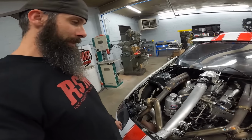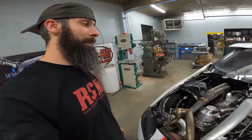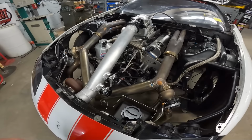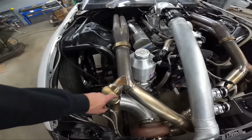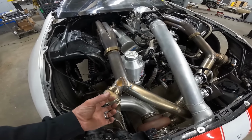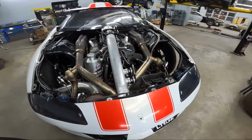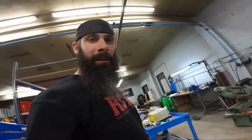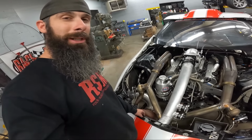Everything is put back together, and we got the piece of the pipe welded in, and he is ready for PRI. Besides a good detailed job, the pipes went in pretty good. Had to work on getting this back around where I cut it close to the 90 and it ovaled out really bad. So you can see me going around with pliers and tacking it every half inch or so all the way around the pipe. I even took the torch and turned the pipes a little bit yellow, to make them look like we didn't just fix them before PRI.